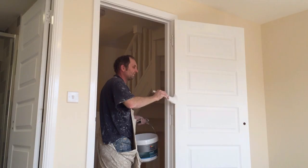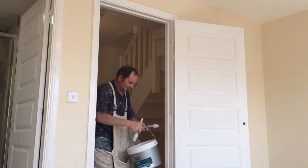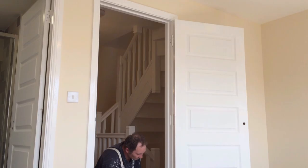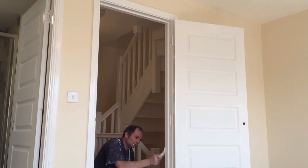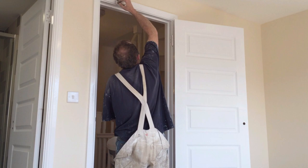Like I say, I've got a door to paint, so just putting that extra coat on these door edges. These door edges will probably get like 3 coats by the time I finish. Just the fact the site agent seems to moan quite a lot about the smoothness of the door edge. Check it for runs, especially on that top arch of both sides.